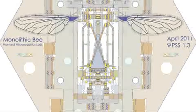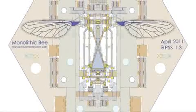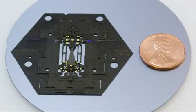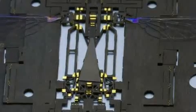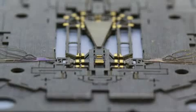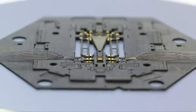Each layer is machined with a different pattern. This top view shows Mobi's design with different colors corresponding to different layer stacks. Viewing the actual device, the majority of the structure is dark carbon fiber. The central piezoelectric ceramic trapezoid, the purple titanium wings, and the golden brass pads are also visible. This flat laminate relies on pop-up book folding to achieve a three-dimensional structure.